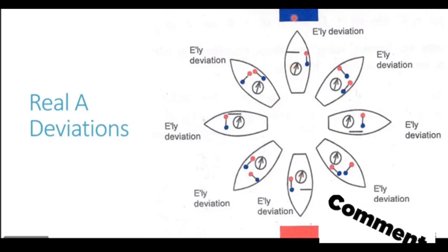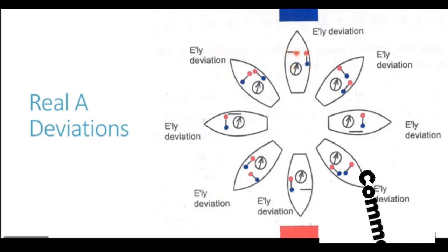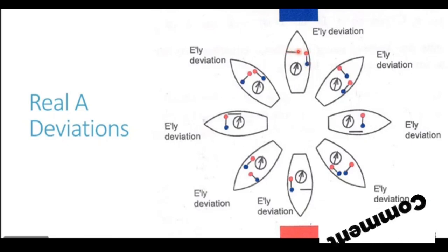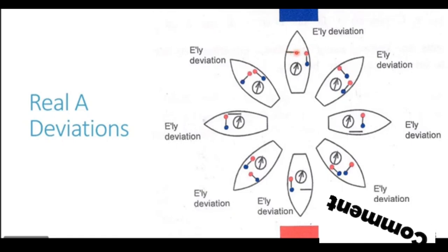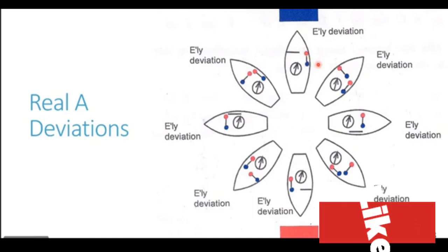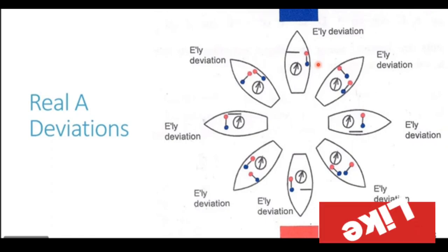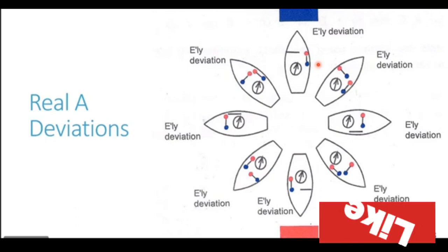Now, with the magnetic field of the earth going vertically upwards, it will affect both these structures. It will affect the fore and aft longitudinal, and it is going to affect the athwartship beam also. First thing to understand is that these are soft iron structures, so they do not have any permanent magnetism. But being soft iron structures, they can get induced by the magnetic field of the earth.